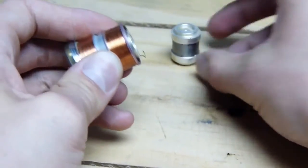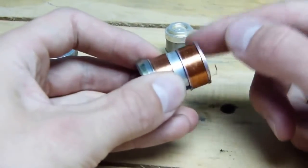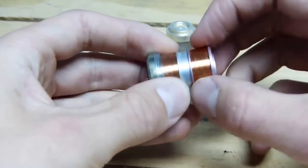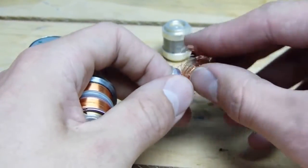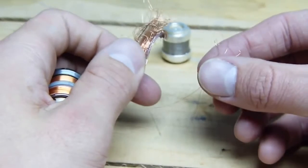So we'll set that here. Now, surrounding the inertial mass is this copper coil. You'll notice there's two of them, and two of them have been placed to reduce distortion — the distortion that was common to earlier Geophones.